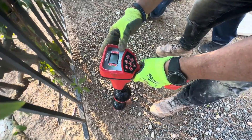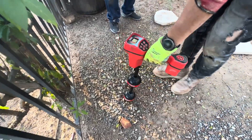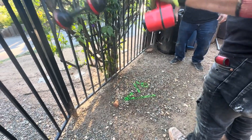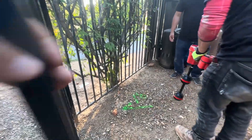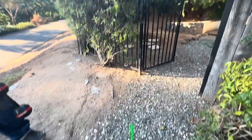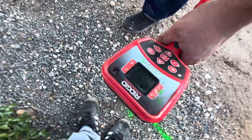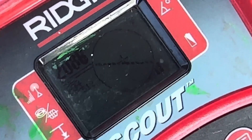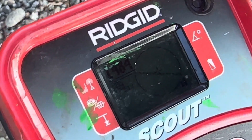Right now we are heading in this direction at an angle and we are right here at one foot zero depth. That's where you're going to get your depths. It will probably go down that little hill — you can see the manhole, heading directly to the manhole. That marker is going to give you depth and direction. You can see that pinpoint on screen giving you several numbers: one is the depth and one is the direction it's going.